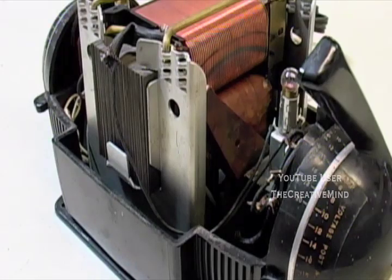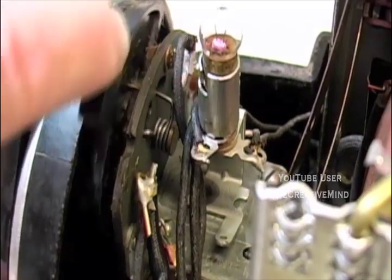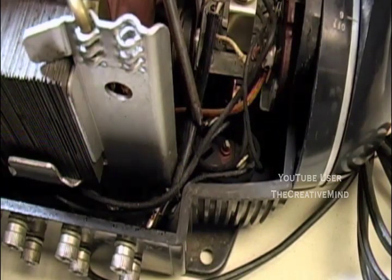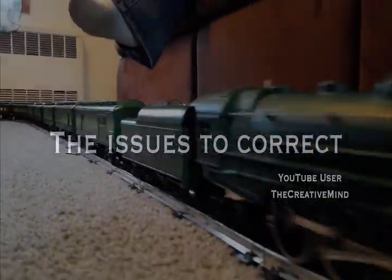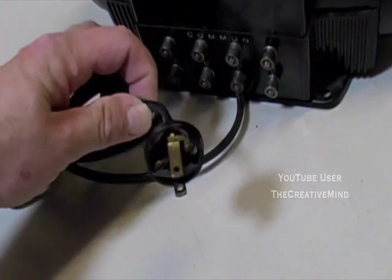Upon opening the lid, we can see the main transformer itself with the primary and secondary windings, light bulb indicators and whistle diode, the directional and whistle soldering board, the circuit breaker, which is located behind these wires. This electrical cord is every electrician's worst nightmare.